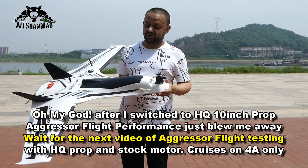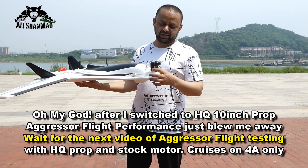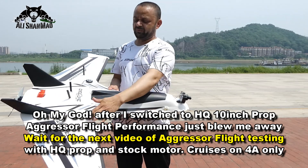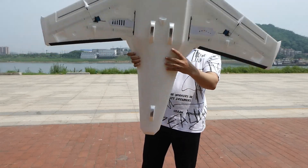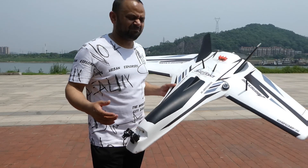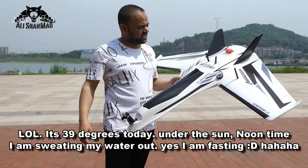I have installed the new servo which is heavier, and the HD camera and a FoxH. I've also removed that tall VTX from here and installed a 600mW VTX down inside the wing. I hope I don't have issues with reception. So anyway, I'll give it a try.